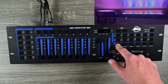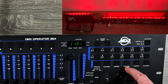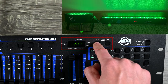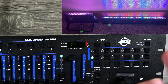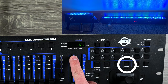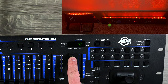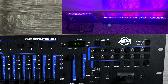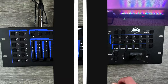I hold program to exit, then hit chase seven. You can set it to auto or manually scroll through them. In auto mode it'll scroll through the scenes at the speed set by the speed knob — all the way up is about ten scenes per second, very fast. That's how you program a chase. The last important step: to control this device with MIDI, hold the MIDI/record button and it will display which channel it's set to receive on. Set this to your desired MIDI receive channel.